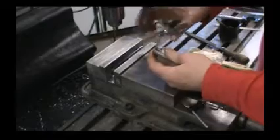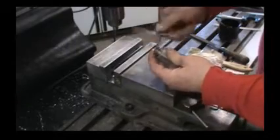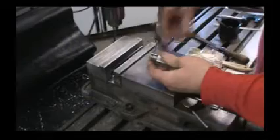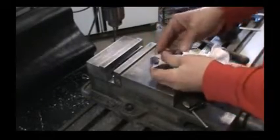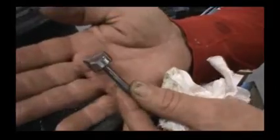I'll make sure my holes are tapped clean through the little wall there. The machine work on the cutter itself is finished. Now we'll harden it. I hardened it using a Mapp gas torch — I wasn't very happy, as the first time I've done it that way. Usually I use an oxy-acetylene torch. I think I got a little too warm; it hardened but not as hard as it could have been. We'll put a little draw on it anyway after the hardening process, then back to the lathe for a little polishing.